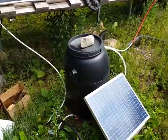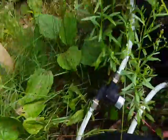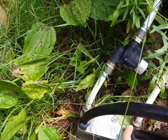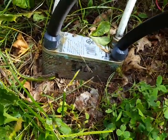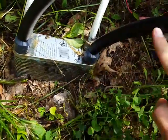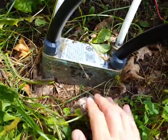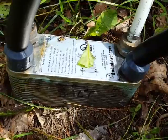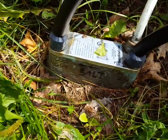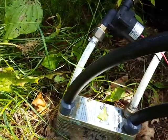So I said I should be using this energy for something else, and what I'm doing is running my pool water through this heat exchanger. Water comes out of the barrel, goes into the heat exchanger. Here's my circulator pump going to my solar panels. That's one side of the heat exchanger, and then the other side is where my pool pump water comes in and then comes out and goes through another piece of irrigation line dumping into the pool. I bought this heat exchanger online — I think on Amazon. It was pretty inexpensive; they actually sell it for brewing. It's from Dudadiesel.com and it does a fabulous job — it's amazing how fast it cools down the water in the barrel.